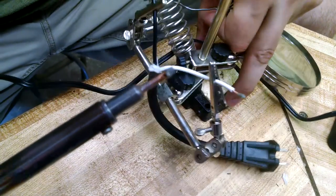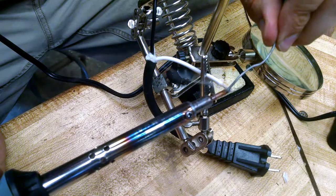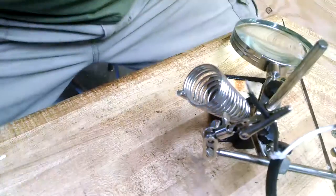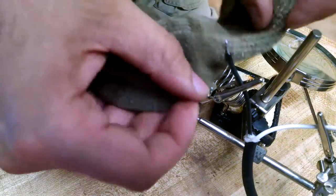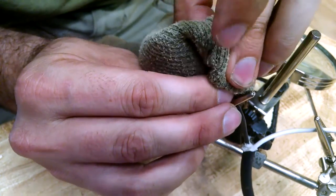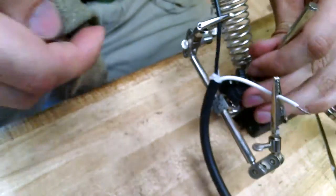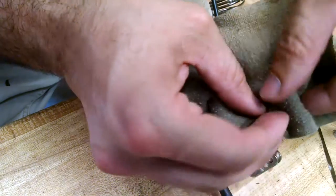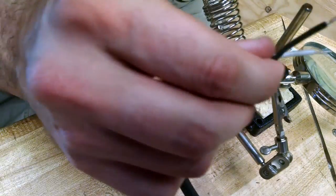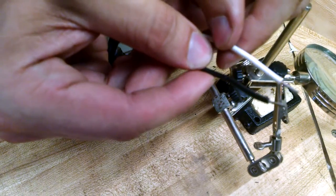And now the other one here — come on, helping hands, help out. And ta-da: tinned. One important detail is when you're done, wipe off the connection here, because any of that flux you leave can end up being corrosive. I'd say about 99.9% of all fluxes are corrosive if left on. So you want to just clean it off the best that you can. I just happen to have an old sock — it's good enough. See, no perforations. Nice and clean.